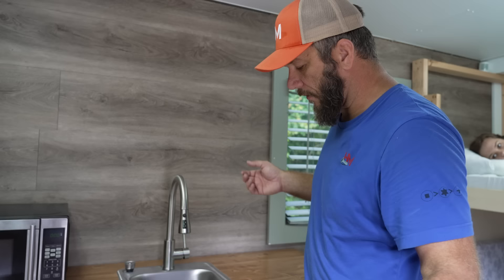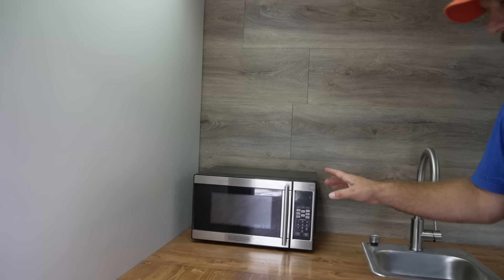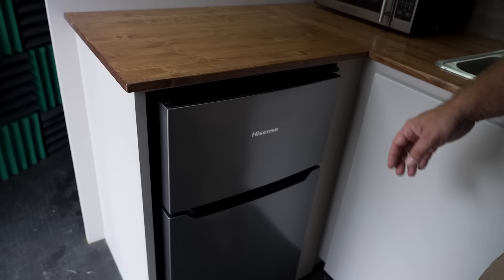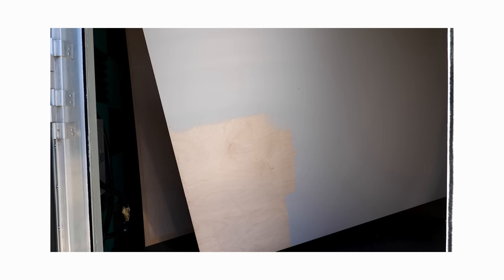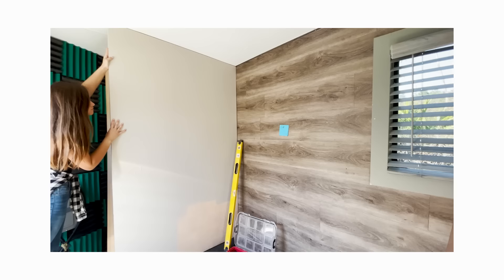I've got the microwave in here, and I just put that grommet back there so I can plug into the surge protector. The refrigerator I ordered — same deal, just plugged into that same surge protector. The wall that we added is four by fours that I split, so it's two by twos — actually one and a half by one and a half — and then we covered it with quarter-inch plywood on top of that.